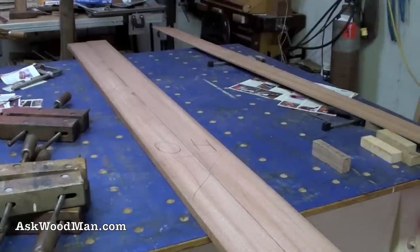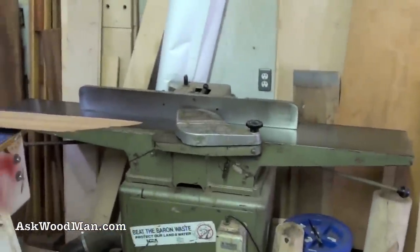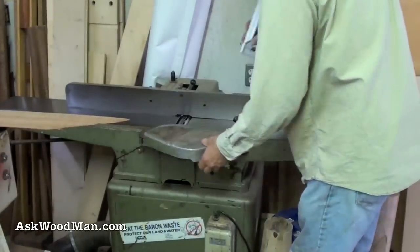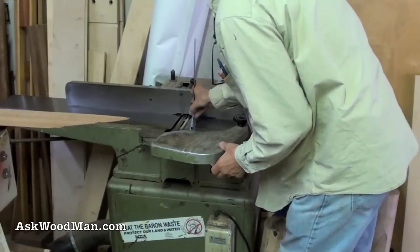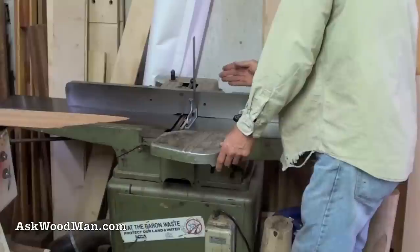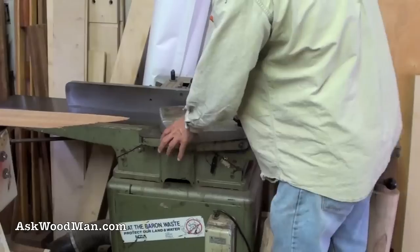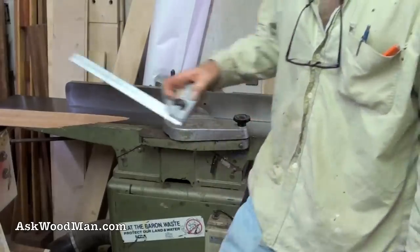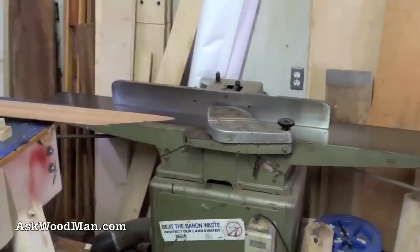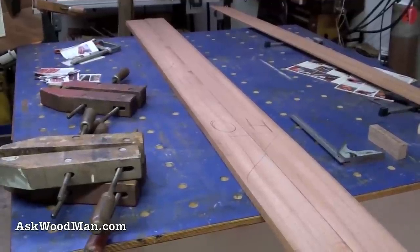The very first thing you want to do is go to your jointer, and I come in with a good square to make sure that my fence is as square as possible to the infeed table. But it's never going to be 100% perfect — no matter how close you measure, there could always be some variation. This is how you get rid of that variation.